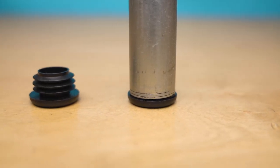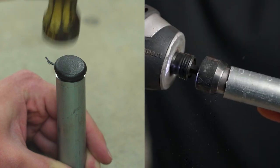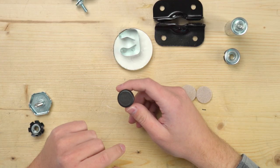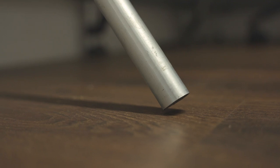First, we're going to start simple with these inexpensive plastic end caps. These are great project feet and install really easily. You should be able to just push them in by hand, but if you have trouble, you can tap them with a hammer or deburr the conduit end to make the process smoother. If you do deburr the pipe ends, the cap tends to pop out easier, which actually could be more of a benefit than a disadvantage, depending on your project. This specific version of the cap also works best on pipes that sit flush with the surface, but they do make some other variants that you can do some cool stuff with. The set angle and dome version of the caps allow the pipes in your build to be angled because it compensates for the difference. This is great because you can do a unique leg like this and no longer have to worry about the pipe edge digging into your floor.